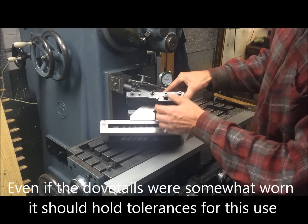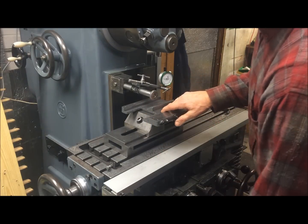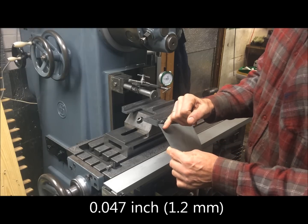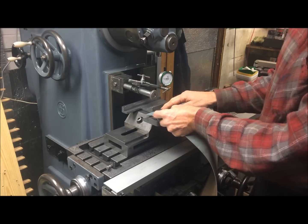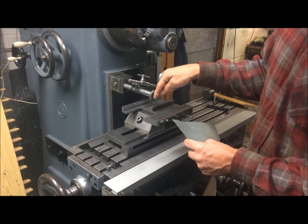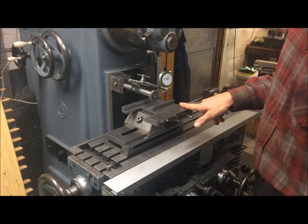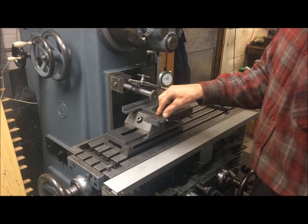I know these should be okay now, so I will mill this down to the thickness needed. This is the thin type I've used here; I can use a thicker type also, which leaves me with more room for scraping. I'll use the thicker one so it will fill up to the required thickness — I mill it down, and it will be the thickness it shall be, so I need not care about shimming. This is where you locate the apron.